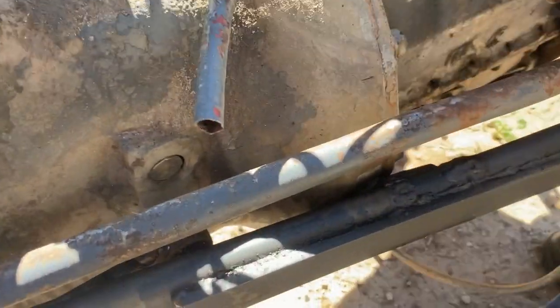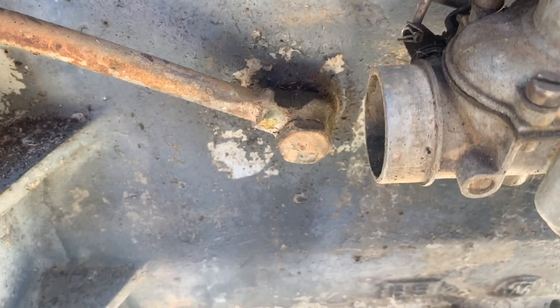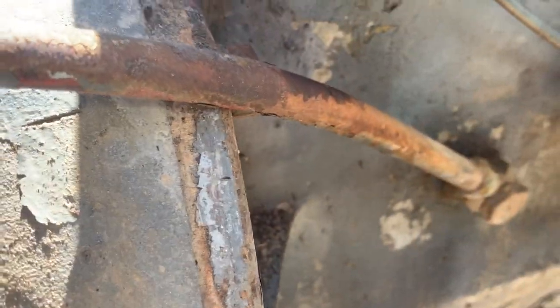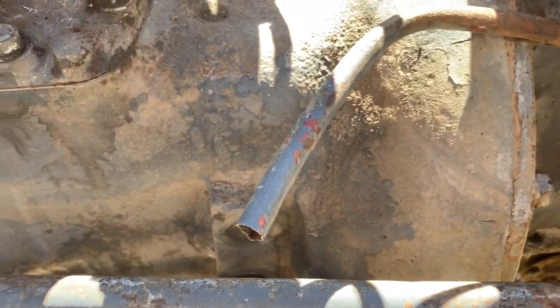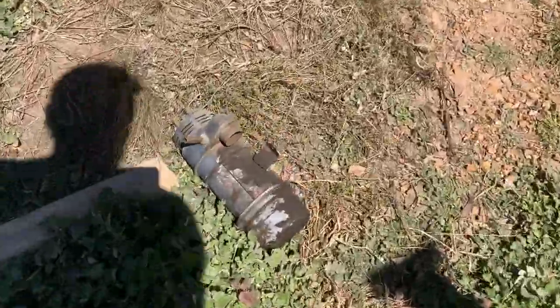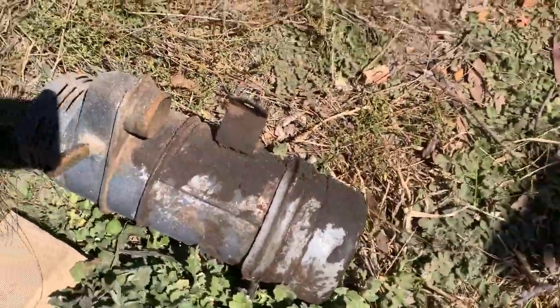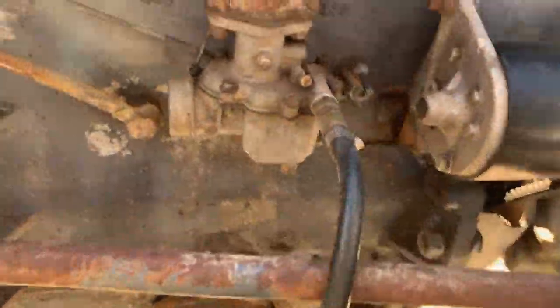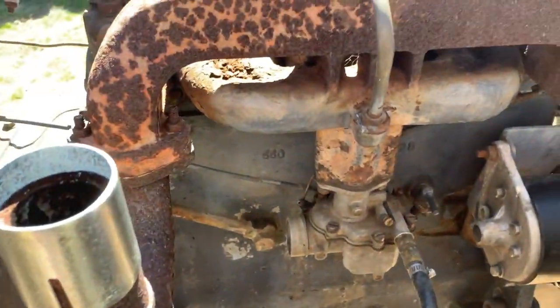That's a breather pipe, you see. It goes from that crankcase down the bottom. Ooh, see that? That's called a banjo bolt there that allows the gas to carry out through the middle of the bolt, so hollow bolt, and then out the side of it into that pipe, then it throws it over the side. It did used to put it into an air cleaner, which we've removed because it's an old oil bath air cleaner and I'm not sure they'll like them. So we're just going to put a little paper cone one on there.